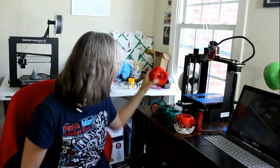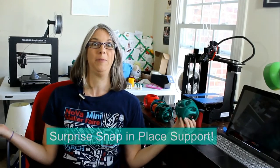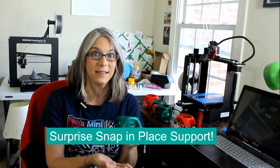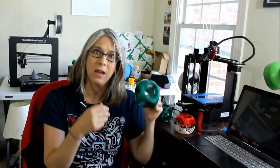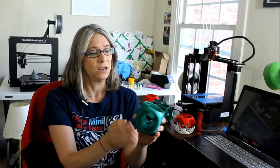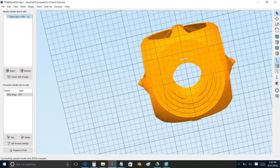One day, I think it was the five-year-old, when he chucked it full force against a wall, it survived — actually it was this one that got chucked against the wall. It survived, but some of the cubes popped out of their placements. And I discovered that they popped right back in. So what this opened the door to was: I didn't have to print these as print-in-place with the support material. If I could snap these things in, screw the support material — I can save some time and some material. So I opened the door to printing it for snap-in-place, where all the spheres were flush, like the ones you see on Thingiverse.